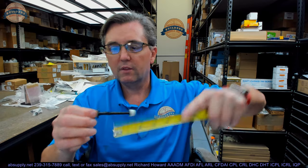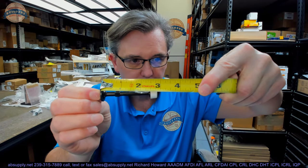What is important to note is that overall projection. You will want to make sure that what you are stopping — again 2 and 13/16 inches — does not have a projection greater than this stop. Meaning if you have a commercial grade 1 lever lock, it is very likely the projection of that trim off the door will hit the wall before the door hits the bumper. In that case you are going to need a longer unit, a greater projection.